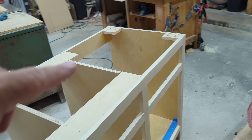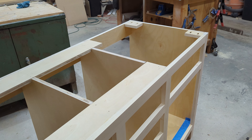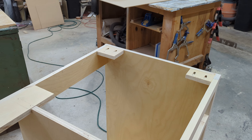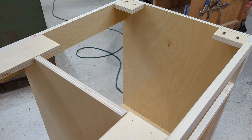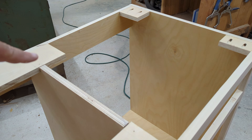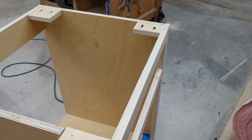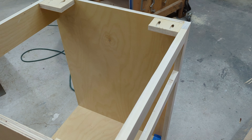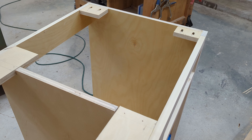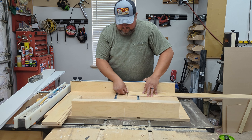One thing I didn't think about: we're going to have a sink on one side. When the granite guy came out to do measurements for the undermount sink, he mentioned making sure there was plenty of room inside. I ended up jigsawing out a stretcher piece that went all the way across — same thing on the front. Then I used my multi-tool to cut the nails to get it out of the way. So if you're planning on a sink, just make sure there's lots of room in there for it.